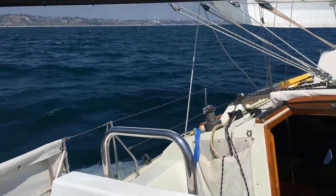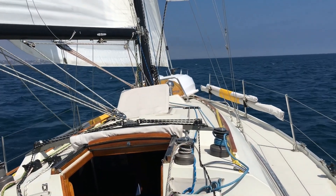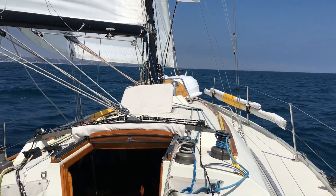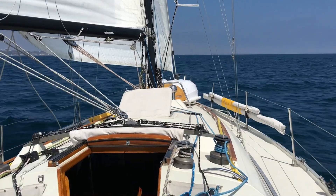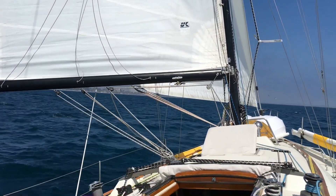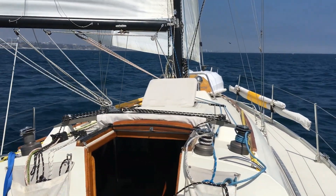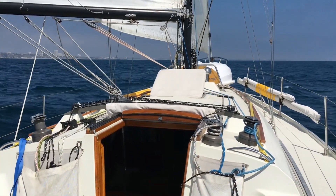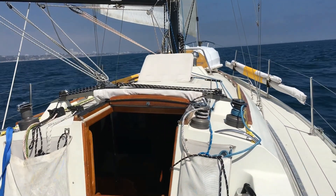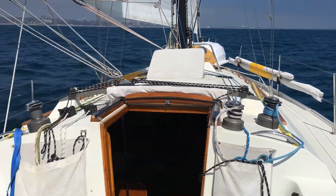Now for me this is still too active and hysterical a series of corrections to be acceptable by a wheel pilot. So let's say the wheel pilots just don't work — everybody's right. It's simple day sailing in 12 knots on a broad reach, and the thing just doesn't work. But the issue here is that the mainsail was not trimmed correctly, and by merely letting the mainsail out about three feet, the boat was balanced again, and the wheel pilot continued on sailing with more attention to the course than you or I ever could.